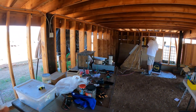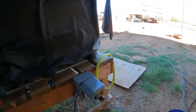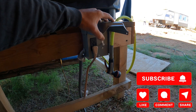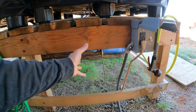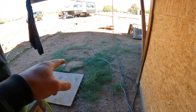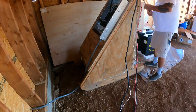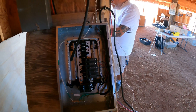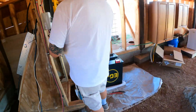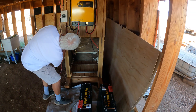We're on day two of working on solar stuff. We had to go into town and get more parts and supplies. We got the waterproof box for the water pump — that's really the only electrical thing over here — wired into the panel. We also got a grounding rod hooked up, loosely ran. I'll eventually come in and zip-tie everything nice and clean. The load center is firing up. Dad's working on the inverter right now. We got our two batteries in, and I did some spray foam in there to close up gaps and holes — I don't want that to be a mouse house.